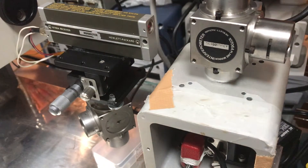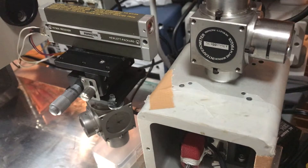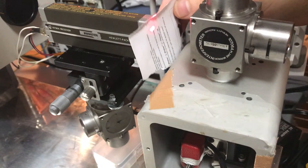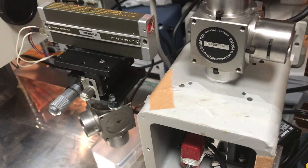Once I've got them aligned with the small aperture, I then move to the larger aperture on the laser, and you get much more overlap because the beam is bigger. That gives you a much stabler system and you don't lose the measurement signal anymore.